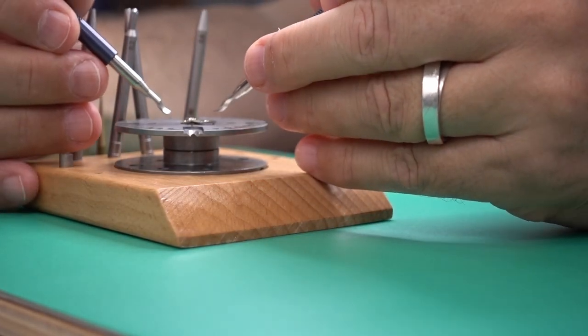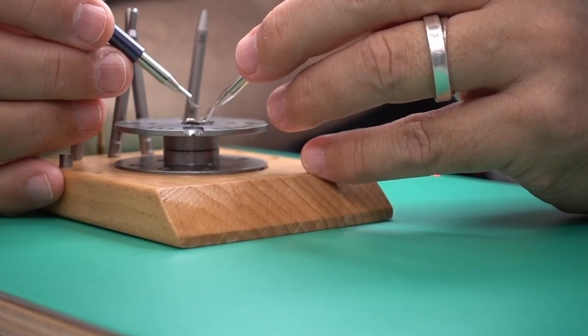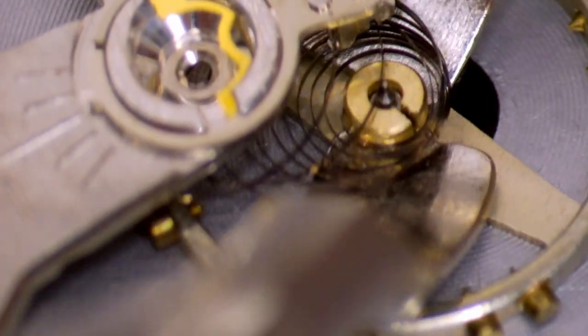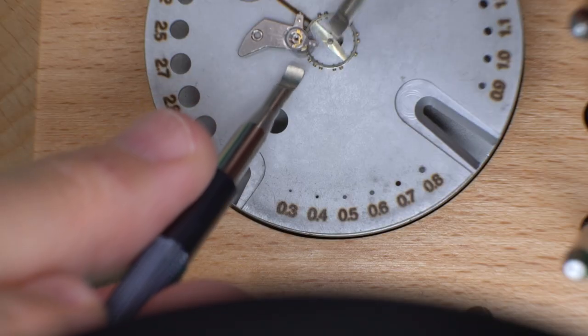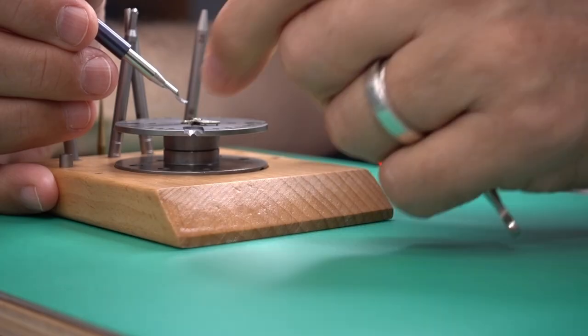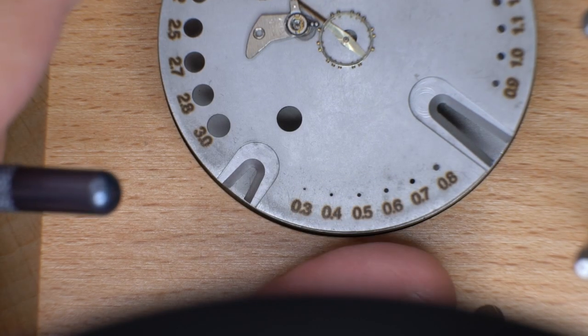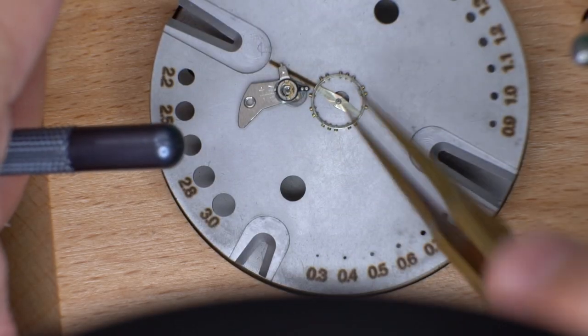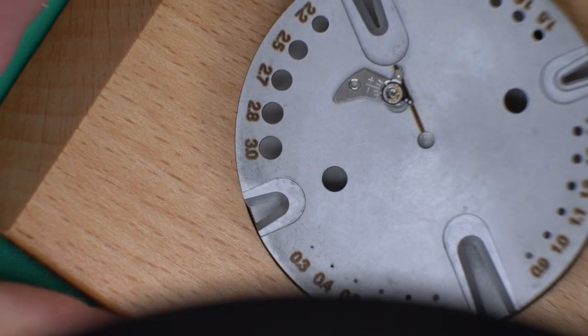So I'm going to try to go under the roller table, like this. Hey, that worked. Now, is that thing still attached to the hairspring, or is it about to fall off? So this is the rivet that I have to break next. Put that there. And then...